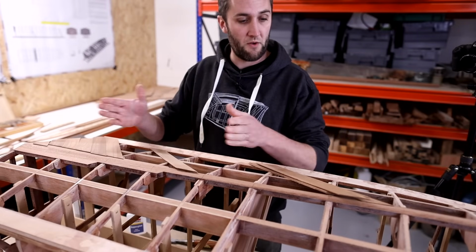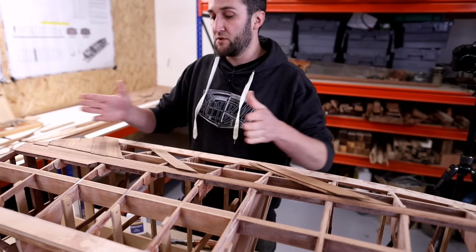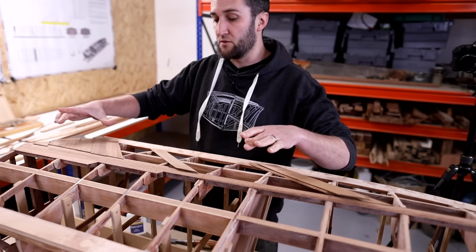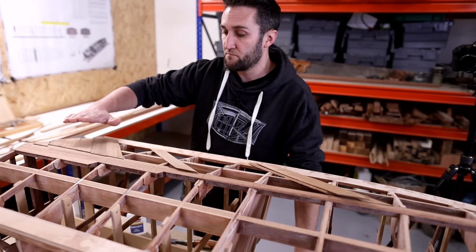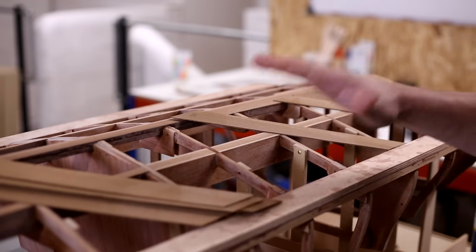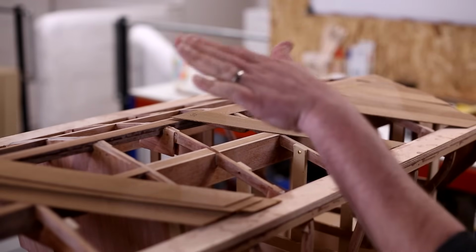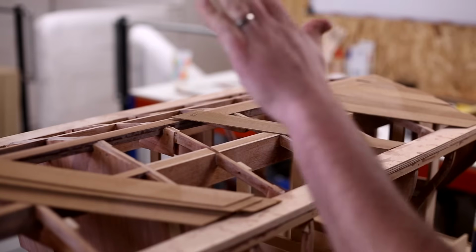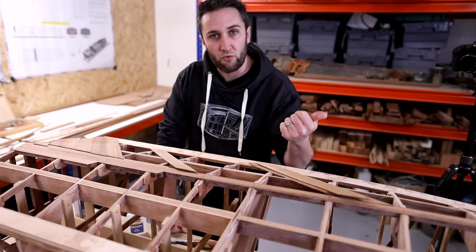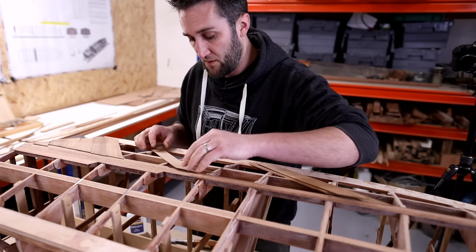I'm a little bit further aft, but somewhere around frame nine, probably aft, because the planking is going to fall much at 45 degrees in the first layer. From there aft, what's going to happen as we go forward with the planking is that the angle at which that plank meets the keel is going to change slightly in order for us to get it to lay properly. So we don't really want to start up at the bow, you want to start a little bit further aft, which is what I'm doing.